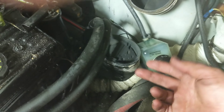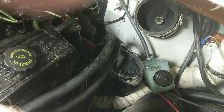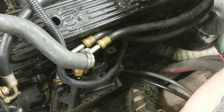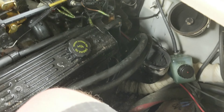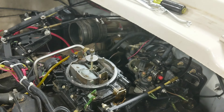I've got the captain's call out so I just need to get the other side off. Here's your exhaust flapper right there - that keeps water from rushing back up the stern drive. This harness should be able to flop back over into the corner and get out of the way. Actually not too bad. I'm going to get on the other side and do about the same stuff.